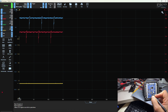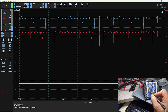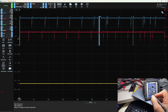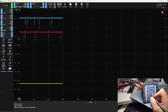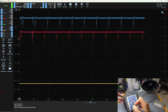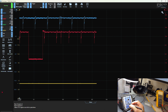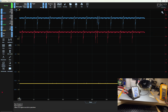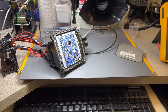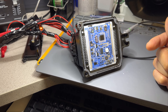We can immediately see the red channel working. If I do the same thing on the other side — let me just follow that — it should be here, we can see it on the blue channel as well. So this is what the computer is not doing. Every time I do that manually, we can see the response of the injector driver. Yeah, it is definitely nothing — at least nothing that I can work on.